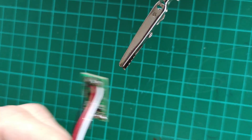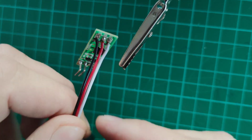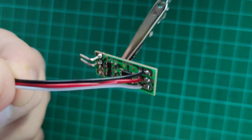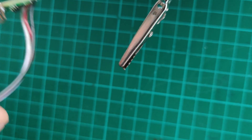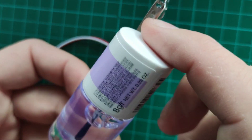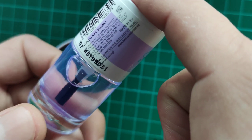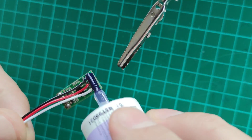The final step before mounting the PCB is to add some water protection. The heat shrink tube that was originally here is not a good solution because it only protects against splashing, and I want something which is really waterproof. A very cheap and effective solution is to use nail polish. You could also use some kind of plasti-dip, but nail polish is a cleaner solution. And use a lot of it.